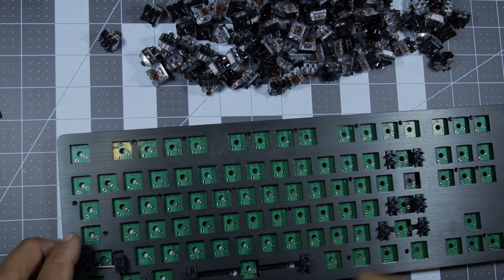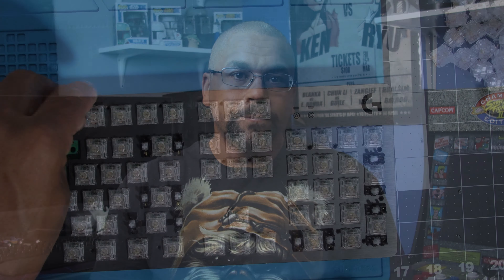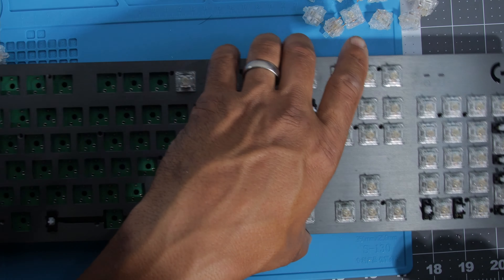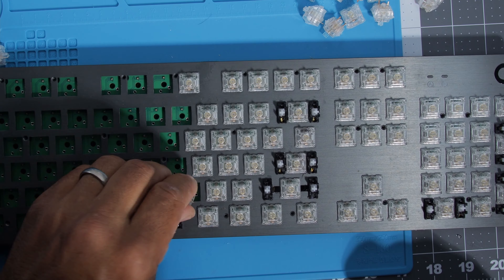As I mentioned, I took care of modding the new stabilizers on the front side, so it's just a matter of band-aid modding the board and installing the new stabilizers. I had to use two of the original stabilizer bars as Logitech uses some non-standard key sizes. Stabs are in — now we install our switches. Once the switches are all installed, we can flip over the PCB to access the bottom side where the legs will be soldering.